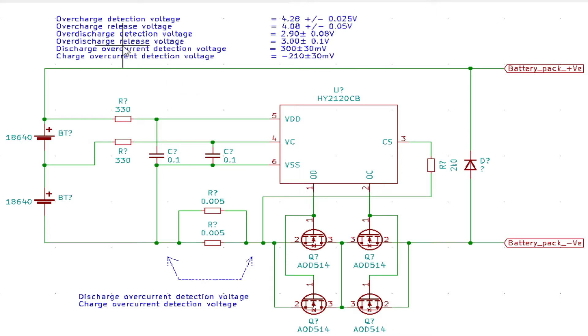If the voltage drops below 2.9 volts, the over-discharge line goes low, switching these two FETs off — so the current is effectively blocked by the diodes in the FETs. In normal operation, both lines are high, so all the FETs are turned on and current can flow in either direction for charging and discharging.